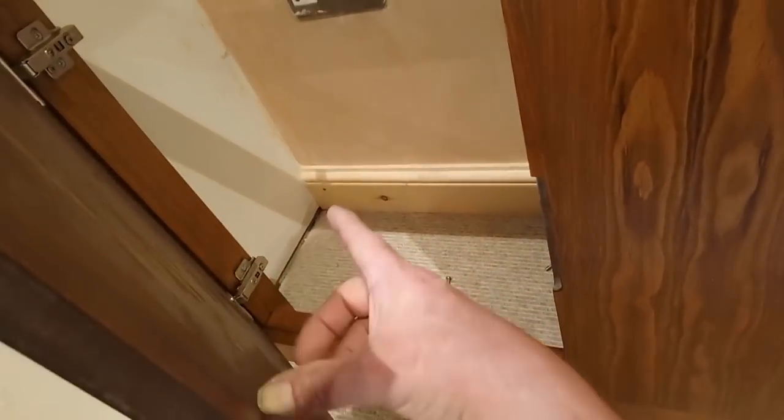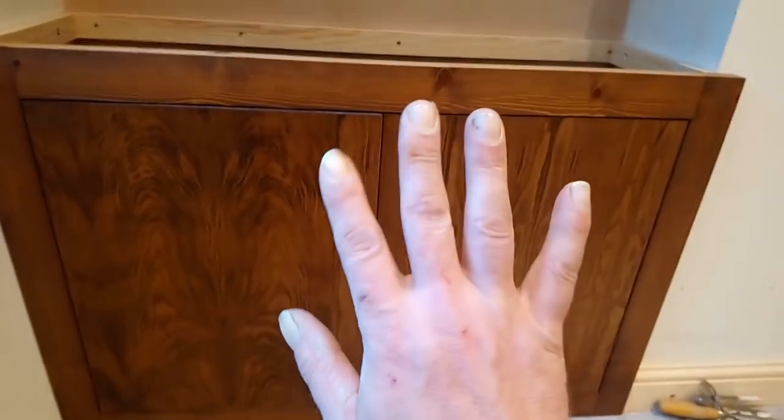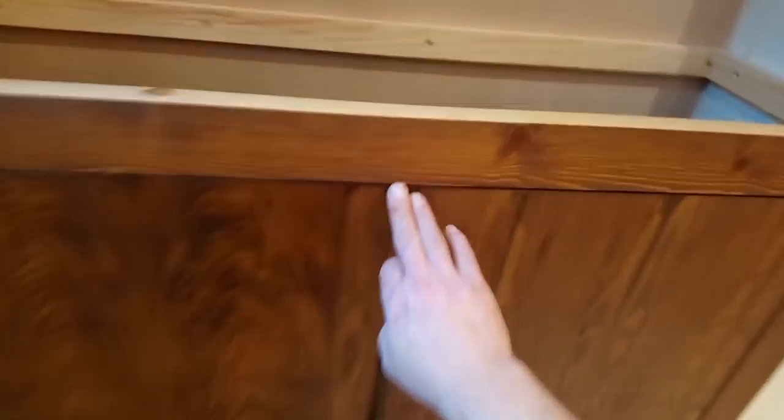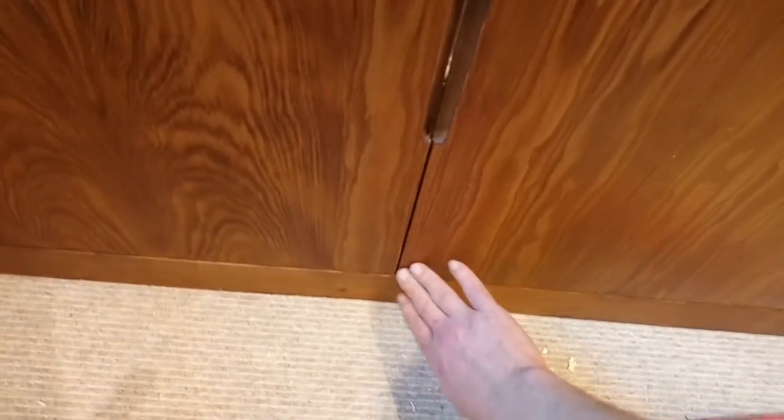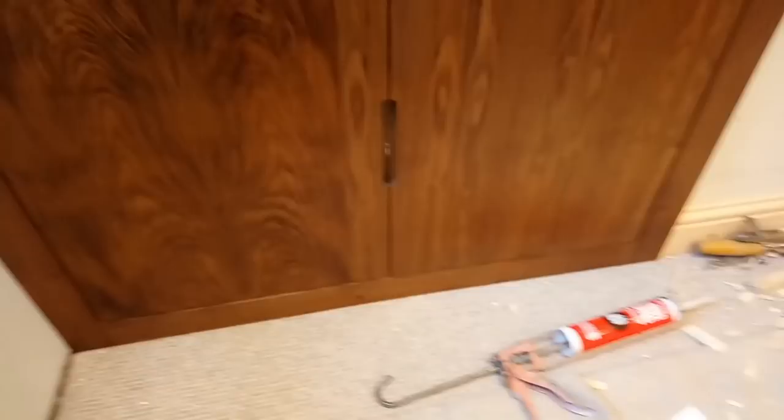But basically, put a bracket on there, there's a bracket on there, there's a screw down there into the wall. And that side, I say, was left loose. It's going to be skirting on there, and with that I could push that in and out, and that made the joins, made them so that they're not twisted, not slightly out, just needs to be pulled out. Give that a tap.